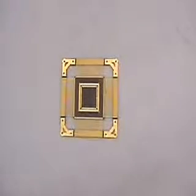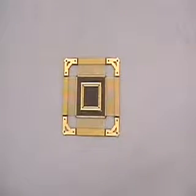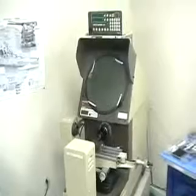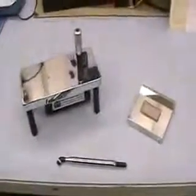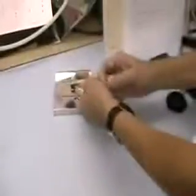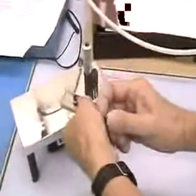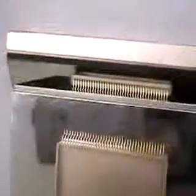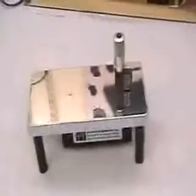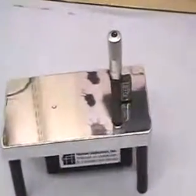Number three, an inexpensive part to test your setup — sometimes it's necessary to tweak a dimension on the cutter or former such as standoff height. Number four, a comparator or similar measuring instrument to inspect the test piece and some or all of your finished parts. Number five, a heavy duty vacuum pen for handling parts. The HP 100 vacuum pen is supplied with three different size tips. Number six, use a coplanarity inspection mirror to visually inspect for proper coplanarity. Number seven, a standoff measuring tool — a useful benchtop device for measuring finished standoff height on a formed part.